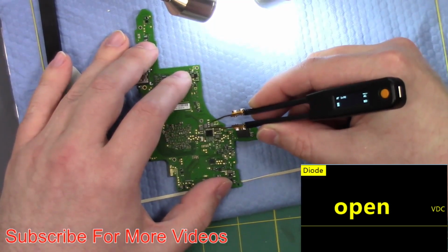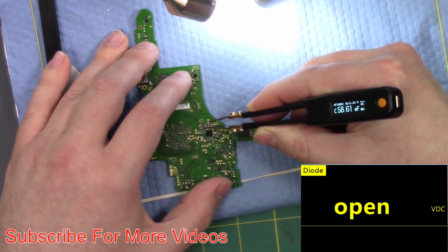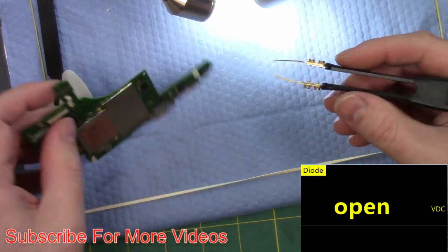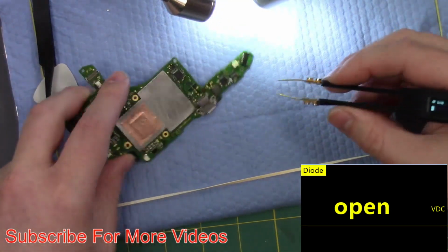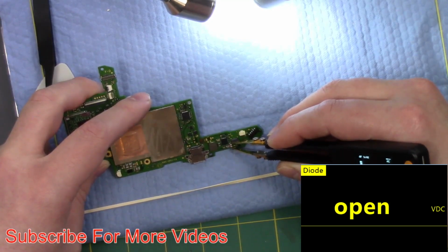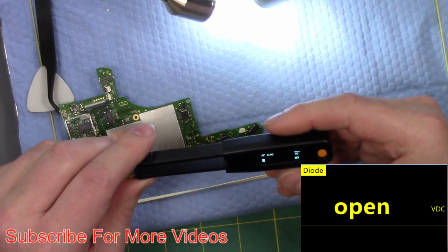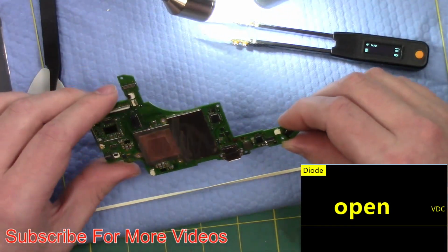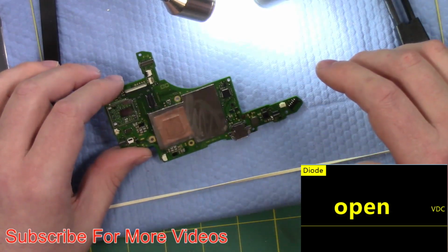If I put it on auto, it'll measure it as a 58 microfarad capacitor with a series resistance of 11 ohms. I don't know if that's an exact reading, because if I read this capacitor over here on this battery management chip, I know this is 1 microfarad. And it's reading as 4 microfarad because it appears to be in series with some other ones. So it's adding up, but it's 4 microfarad. I know that's 1 microfarad because I pulled it off and checked it with a donor board. It's 1 microfarad.